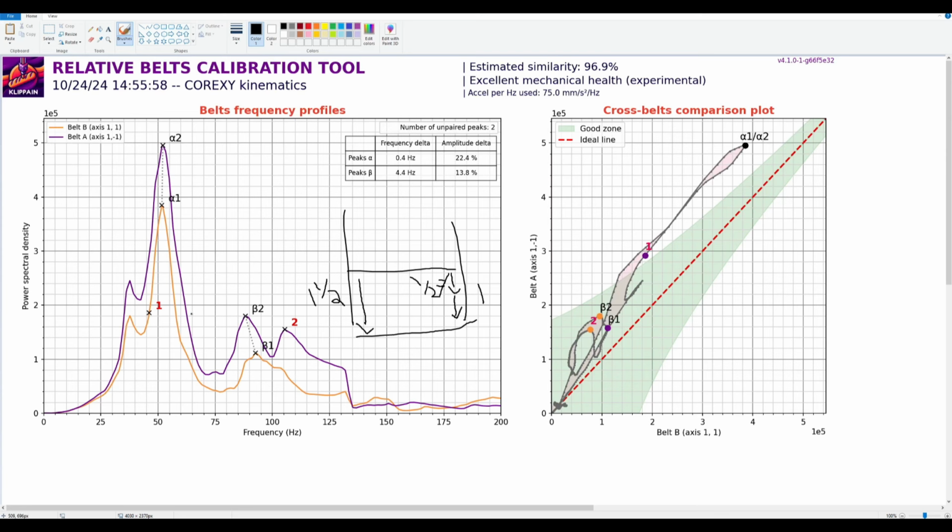But when I run the graph, I get something off. And it could be because of this, right? Even though the tension's the same here, they're actually racked. And what the ADXL is measuring, when it does it, it's measuring the diagonals, right? So it's going one way, and then it's going the other way. It's measuring this little bit here, which would be our delta, right? So that's what it's doing.